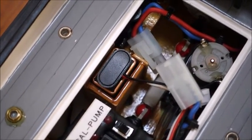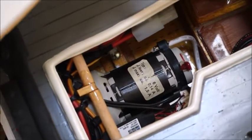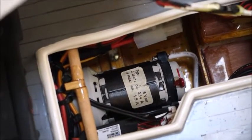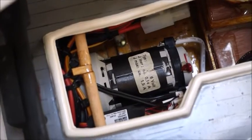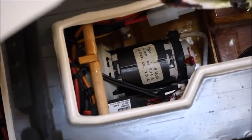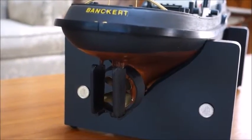Now lifting off this structure — in here we have the original motor. This motor actually has a gearbox located in the back, which you can't see, suitable for a number of projects. It has a forward/reverse switch in the front as well. With the gearbox you just need to use the fastest speed you can get to power the tug, and the rest is basically bells and whistles. That's a little homemade connector with some Arduino connectors at 0.1-inch spacing.